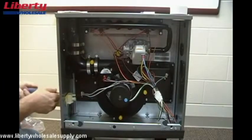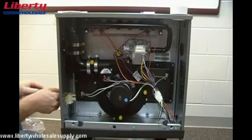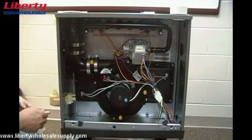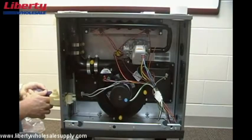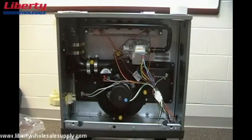I pre-drilled these holes — you need to be aware that the cabinet does not have holes already there, but there are dimples exactly where you need to drill for the condensate trap installation. Make sure that when you tighten this, you do not over-tighten and break the flanges on the condensate trap. Once we have that in place, we'll install the hoses necessary to drain this furnace properly.